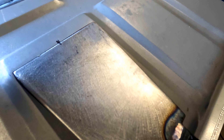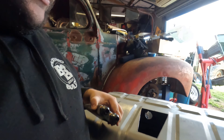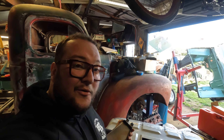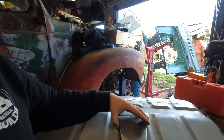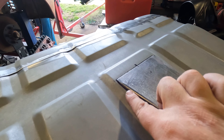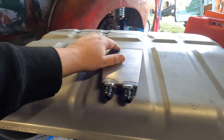Now that clearance is all good I've gone and marked the perimeter. What I'll do now is cut that hole out and we'll start to tack the sump in. This is a bit of a case of where I should have taken my own advice and made that taller — I forgot the spare wheel cutout was in there. So I was going to weld it from the inside but now I've got no choice but to weld it from the outside. Luckily I'll be able to do it with the gas lens. As far as fit-up goes, that hole I just cut is pretty bloody good. Nice weld along there, really nice welds down the sides. As you can see quite a nice fit — sits there on its own. I'm really happy with the fitment of that.